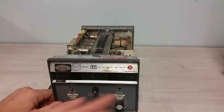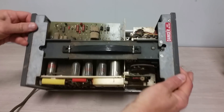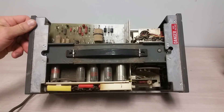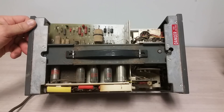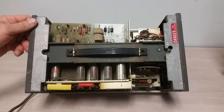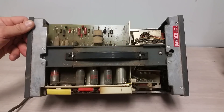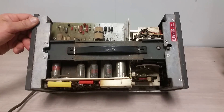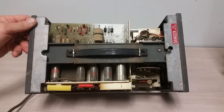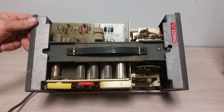You can see this apparently belonged to Eclipse Pioneer at one point. You can see we've got tubes and transistors, and we've got a TO3 down there. I believe the input stage here is tube, because the specs on this — I did look them up — they're not that horrible actually. I believe this does use a tube for the input, just so you have at least some decent input impedance.